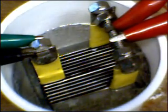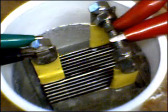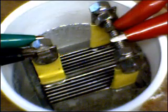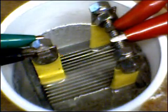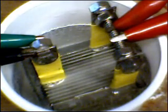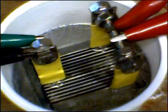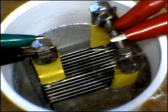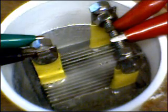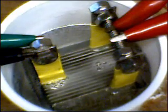I'm going to show you what 13.8 volts looks like in my new cell. All right, here we go. 1, 2, 3. And what did you see? That's actually 14 volts, 1 1/4 amps. And you can see very clearly that with that amount of voltage dropping across each cell, I am just barely at the point where the plates are beginning to release gas.